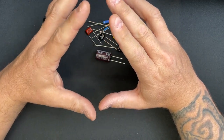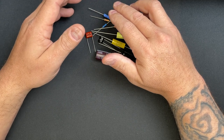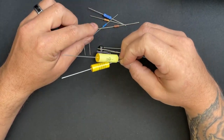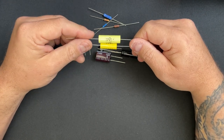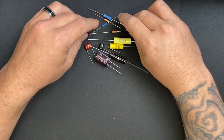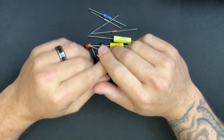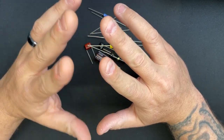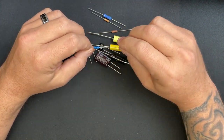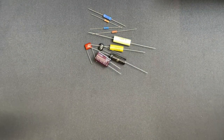I hope this helps you figure out where you want to go. When it comes to capacitors, it really doesn't matter that much on the signal side — pick one and be done. For the power section, keep it quality and spend your money there. For resistors, carbon film is a safe middle-of-the-road choice. If you want the quietest, most stable amp possible, go metal film. That's really all I can say.